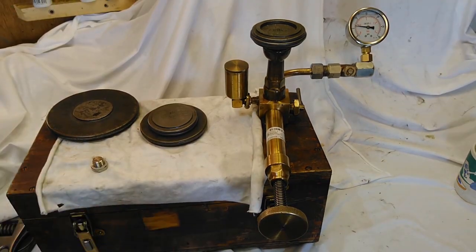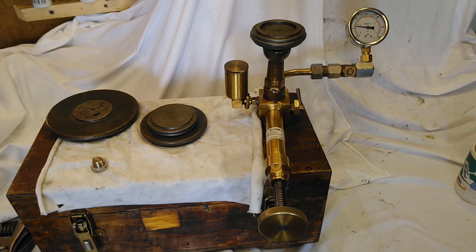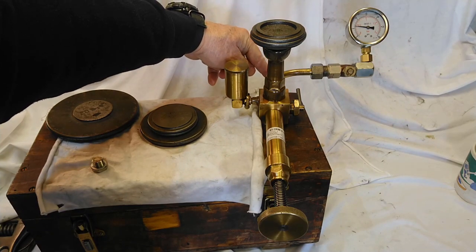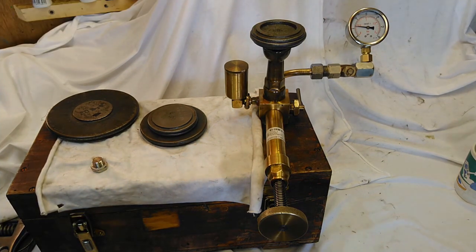And so why, when a few weeks ago at the Heritage Centre it was reading +1 psi, is it now reading +2? Well, let me just find the definitive answer here. Bourdon tubes are intended to indicate gauge pressure in relation to ambient atmospheric pressure. This is different from absolute. So absolute, that's an absolute pressure that's in there. It cannot vary unless I vary this. And ambient pressure is what's around us. So this is reading 5 psi in relation to whatever the ambient air pressure is.